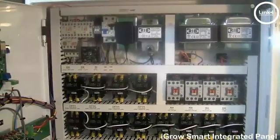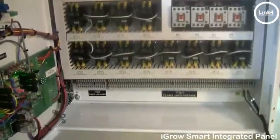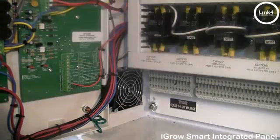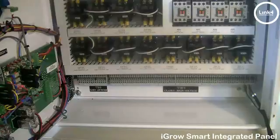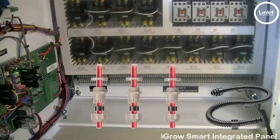All wiring is within raceways, with 2 terminal block points at the bottom of the panel, as well as a cooling fan and a louver to reduce the heat. All your electrician has to do is line and load the terminal blocks and feed the wiring from the bottom through conduit using watertight glands.